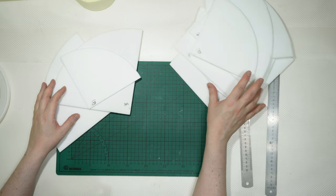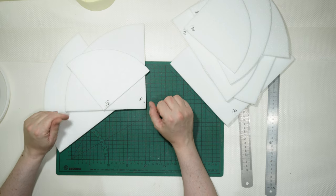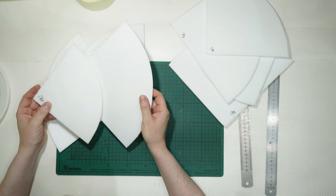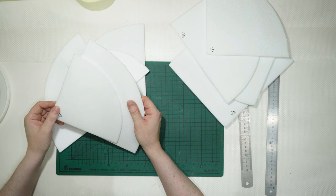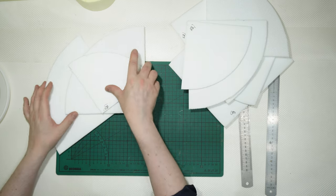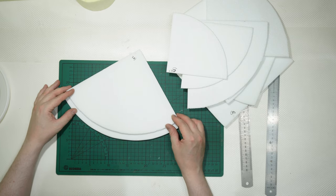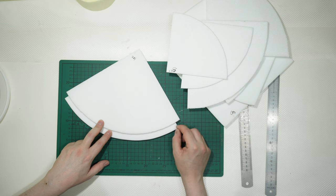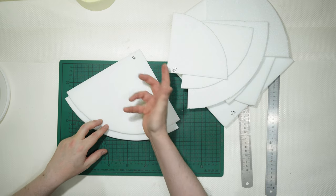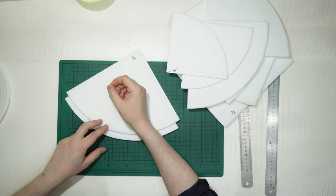Each of the steps, you have nine steps to the left, so 18 steps. But those are cut from circles that have something strange in common. They are not the same center. When placing two steps, generally you tend to do this thing here. So the same distance from here and the same distance from there. So you simply have to make circles that have the same center and different diameters.